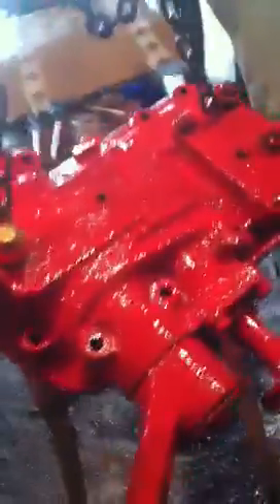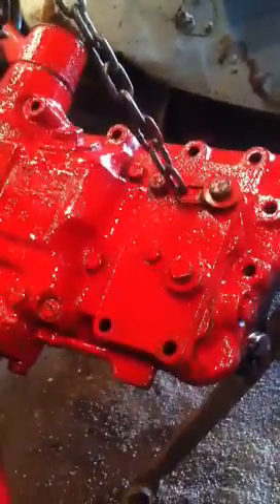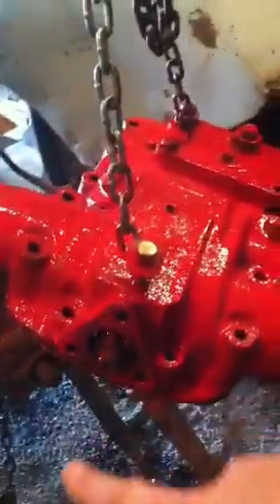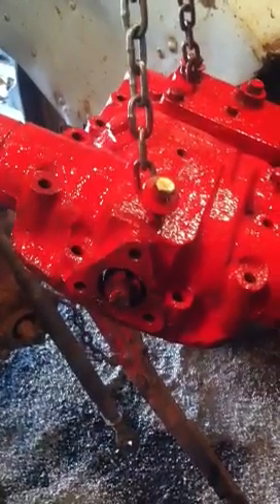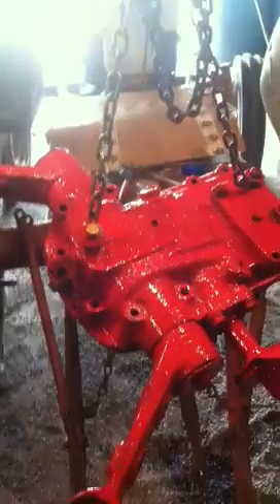So, it's easy — simple parts, nothing hard. That was my goal today, just to show you. It's serviceable, but there is no magic plate to take off that reaches under anything. It's not like a Ford 8N or a 9N where it's in the belly — everything is in this housing and it's all very easy to get to. Ford 600 hydraulic lift arms: arms went straight up in the air when he heard a pop. That's because this draft rod broke. If your arms won't go down, check that draft rod and make sure it didn't break and lose its tension. Ford 600 seat plate removal — no problems. Thank you, have a good day.